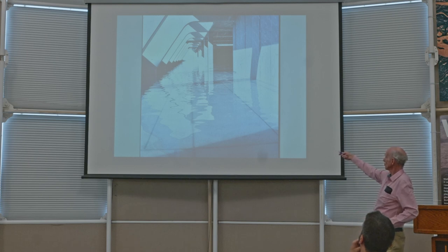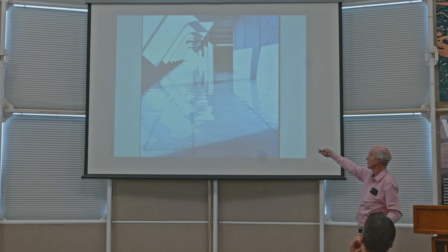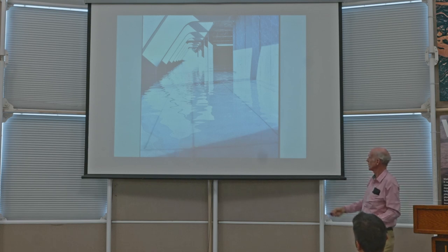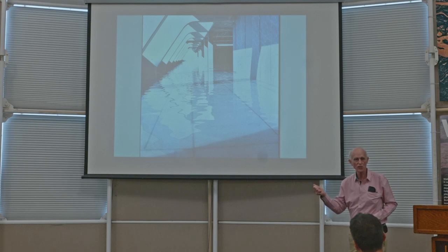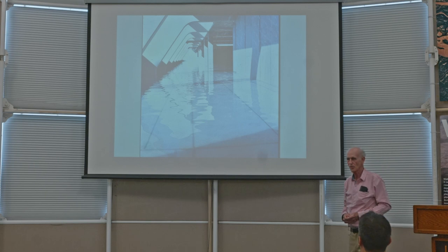Okay, and this is in the intensive agriculture, which is now occupied by the Landscape Evolution Observatory, but in the basement where those trays are for what was the wastewater gardens. And there you see the liner underneath. Those are welded seams. And what you're seeing is a flood of water on them that's about a foot deep. And the point is that in those channels that were underneath the liner, we pumped compressed air. And of course, if there was a leak in any weld seam, then you would get a trail of bubbles coming up through the air, and we would know where the leak was. And we did find a few. So that was a very useful little exercise. Next slide.